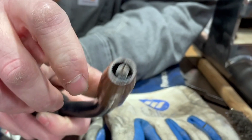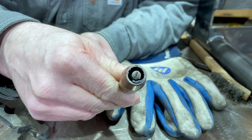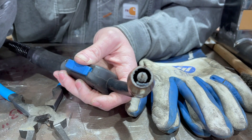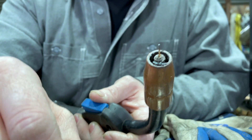Here's the MIG gun. I'm short arcing with it and you can see how you get some spatter out there, and that's not ideal. As that builds up on the inside, it affects the gas flow coming out, and as it collects on the tip, it'll start grabbing the wire as it comes out. You'll start feeling a little catch and that could be what that's from. It doesn't even need to be that much spatter — it could be just a little ball on the end that's dragging. That can have a big effect.